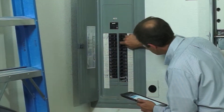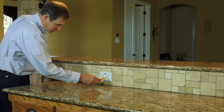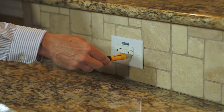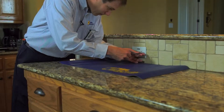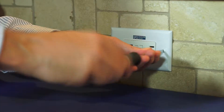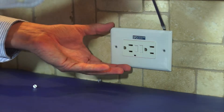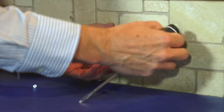The first thing you're going to do for the install is turn off the breaker that feeds the circuit. Use your voltage tester and make sure the power is off for the device you're working on. Next, remove the receptacle cover and then the receptacle itself from the device box. You'll want to verify that the device box is suitable for a GFCI receptacle.